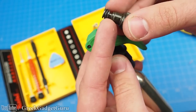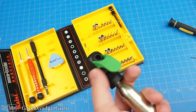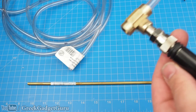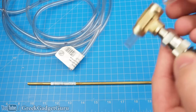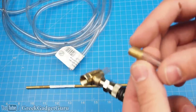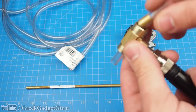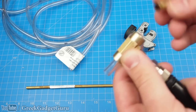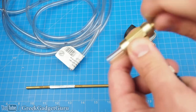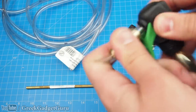You can see this is really airtight because there is an O-ring there. Then we have this piece — you can just put that back on if you want. Really simple. Now I have taken this little T — this is probably a quarter-inch pipe. This portion right here is actually from a 7/32nd brass rod and I cut off a piece using this little tool here and just kind of screw it in place. That gives you enough extra girth to allow it to bite into the threads and then you can turn this piece in, and it kind of pressure fits in there.